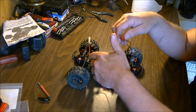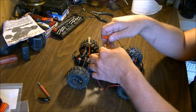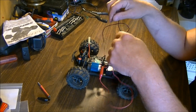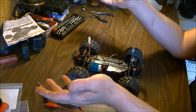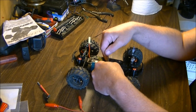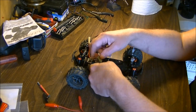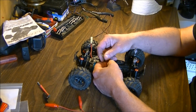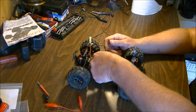If you want it to blow air onto the motor — onto the heat sink to cool the heat sink as well as keeping the motor cooled — then you need to reverse the polarity going to the fan itself. The fan will run both directions. That's how you would do it that way. The other alternative would be to cut your plug off, leaving enough wire to reconnect, because you're going to have to re-strip the casings on each end and then solder everything together. But it's a lot less hassle if you can peel some of this skin back and do it that way — twist the wire on, solder it in place, and then cover it with electrical tape after, because you don't want these two to short.